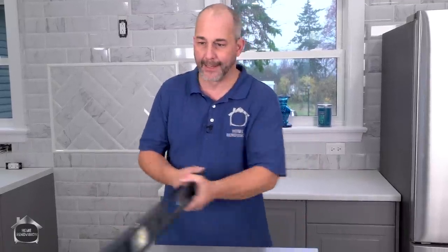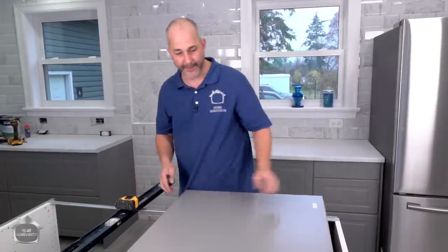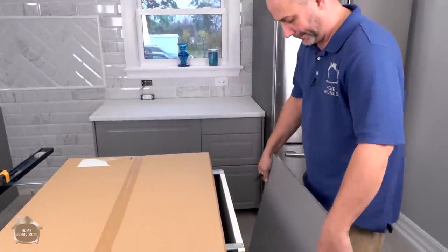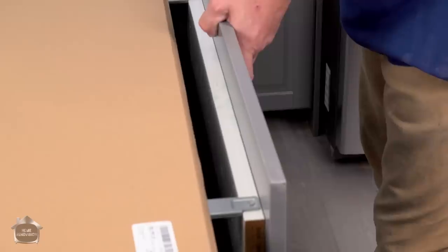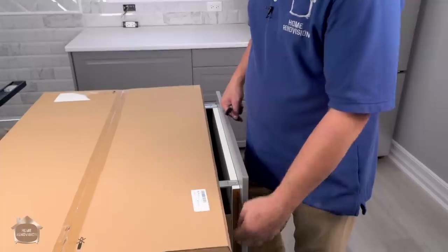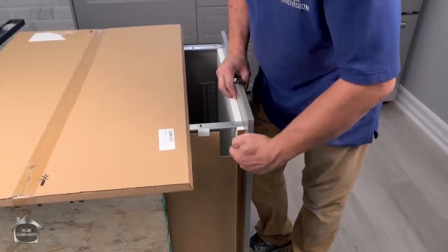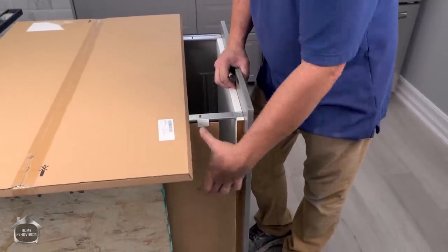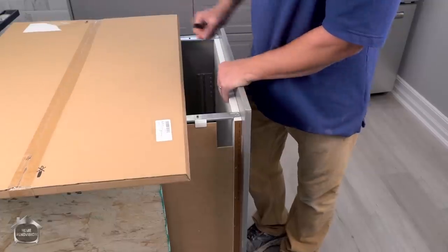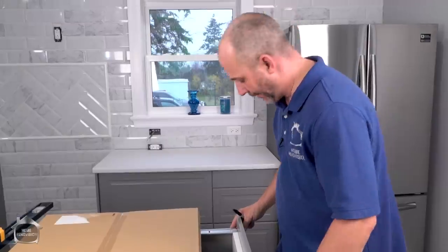They're also amazing in an island because it can encapsulate both sides. This is why they're 26 inches. I'll just demonstrate this before we cut the height. In this scenario, I can go full extension over here for that side. And then over here, I can put a back panel on, and I have enough depth left over to add a back panel and decorative doors. So if I wanted to do a replication of all doors across the back of this to look like cabinets, then you can do that, and you would be perfectly fine to do that.